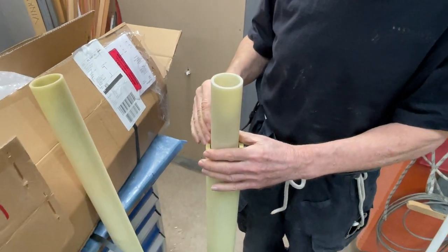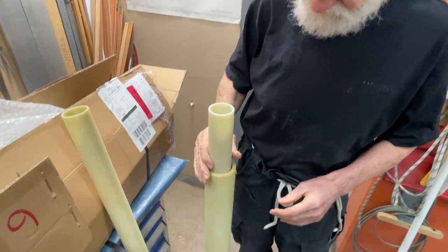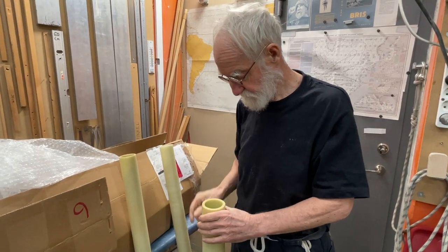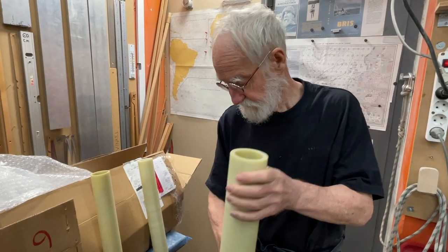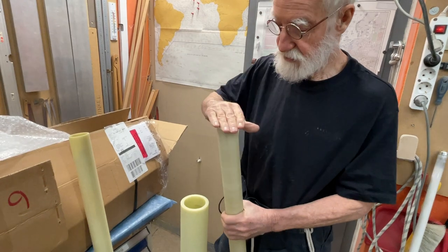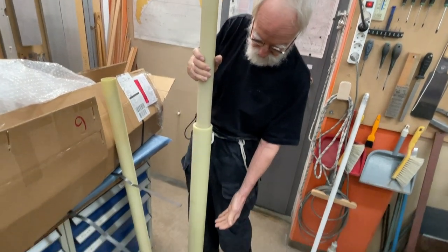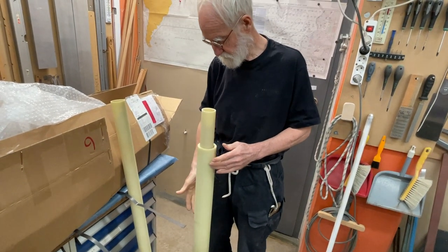So it gets more material, and in here it's going to be epoxy, so they're glued together. Now it's not going to be so easy to put glue in here, so what I did think is: I put the bottom here with the glass fiber, and with the bottom there I can pour epoxy in here. I put the bottom here and press it down, and the epoxy will rise up until it flows over into a little bucket in here.